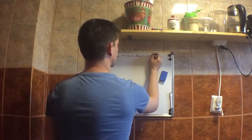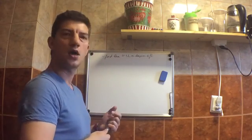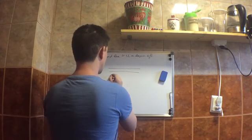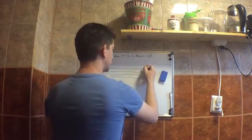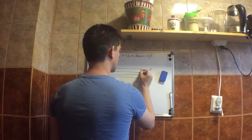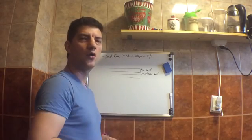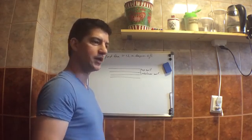The frost line is approximately 1.2 meters deep — that's about 4 feet. Considering the frost line is about 4 feet, your foundation is going to have to be a little bit lower than that. So you're usually just going to be in the second layer of dirt, considering the first is topsoil.